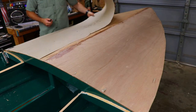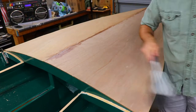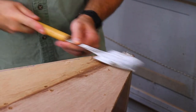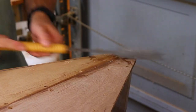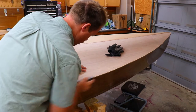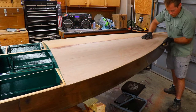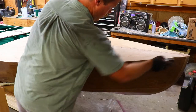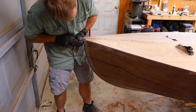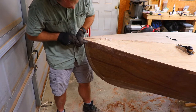The next step is trimming those deck panels down even with the sides of the boat. I do this just like I did the bottom and side panels. I also trim the stem cap off flush with the top of the foredeck. I trim the deck panels even with the sides of the boat using a hand plane, and then finish sanding them flush with the sanding block and sandpaper. This is the same process I used trimming the bottom panels flush with the side panels. In spots, I also use a chisel where the hand plane isn't being very effective.